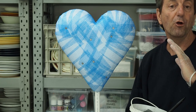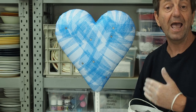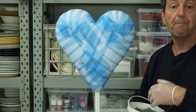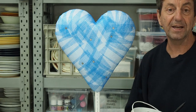Don't do it on a windy day or a dry day or a day where it's high heat, because that will dry the thin set or cement out. And of course, it won't cure that well. So if you're going to leave it, make sure you put a bag over it if it's a warm environment. But I've got the air conditioner on, so I'm just going to apply this without an issue.